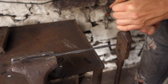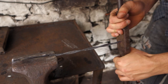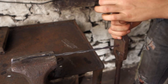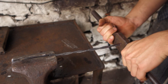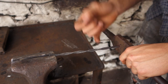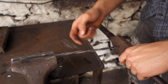I'm going to put them in the vice and do a loose twist on it, which we're then going to have to open out to get the barbs in, because the barbs are effectively just like woven in. They're not welded — they're just put through and then wrapped around. Making sure to pull out on it so the twist stays nice and straight. I'm checking it in the horizontal position so I can see how even we're going and how far I want to take it. That's probably about as tight as it needs to go. But I'm going to have to heat it up to open a couple of these twists out so I can get a bar in for the barbs.